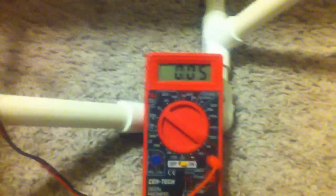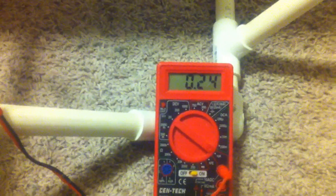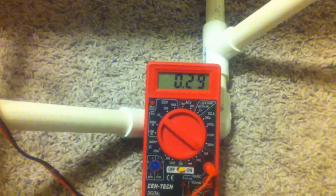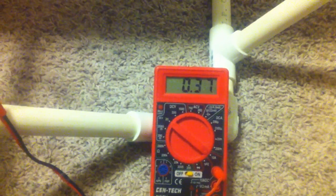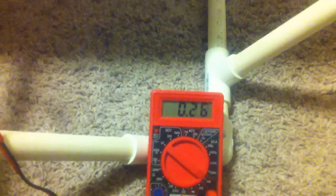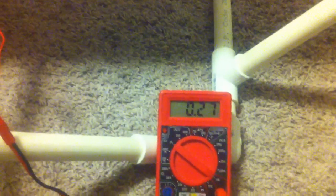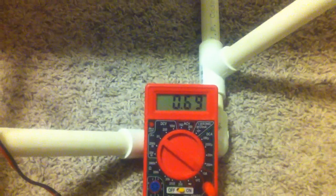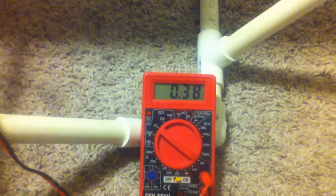I don't think we're ever going to get near that limit. Right now I'm deploying full flaps — that's stalling the servos — and you can see we're at 0.3 amps. Start moving things around and it spikes to 0.7, then 0.8. I'm moving all surfaces here and you can see the flaps are still fully deployed.